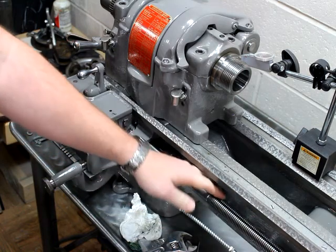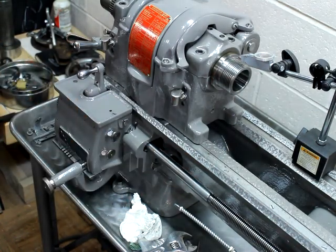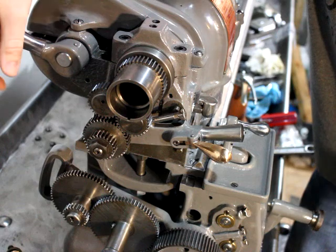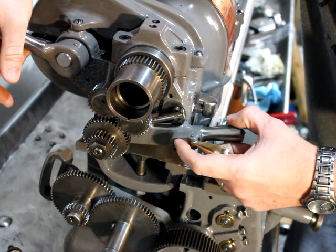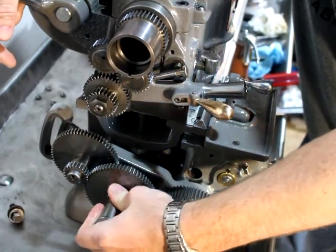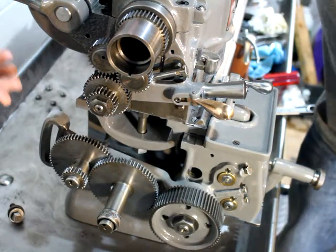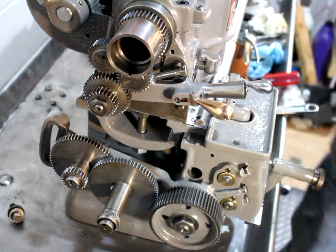I cleaned the lead screw off — I probably spent a good hour cleaning all the threads out. There's a little rough spot I'm going to have to polish once I get this guy running. On the other side, here are my end gears. I got my back gear put in, and yesterday I got my tumbler assembly finished with the knob polished up. The spring in my old machine was worn so I had to replace that, and I got my banjo assembly put back on, so the slide gear works great with all brand new felt wicks.